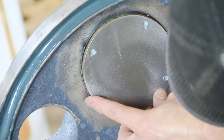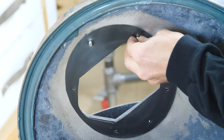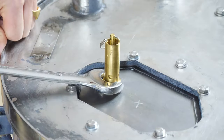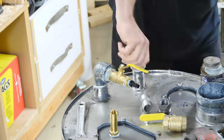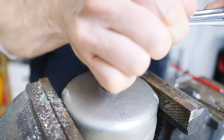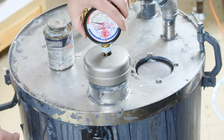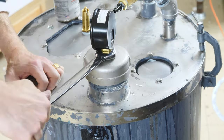Next, I'm going to start assembly. I'll put the plates on — these are held in place with quarter-20 stainless steel bolts. On the larger opening, I drilled a few more holes so I could get even, consistent pressure on the whole plate. There's the pressure relief valve in brass. I'm reusing some of the original hardware. I've stayed away from traditional black iron pipe and stuck with brass and stainless steel — I find that stuff seals a little bit better. Sometimes the porosity of the black iron stuff leaks. This is a three-inch cap over that hole, and I put the pressure and temperature sensor here to protect the probe on the inside.